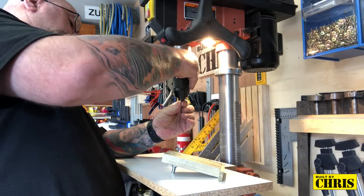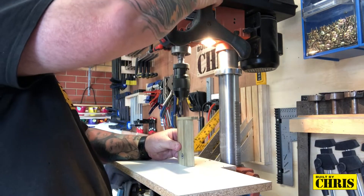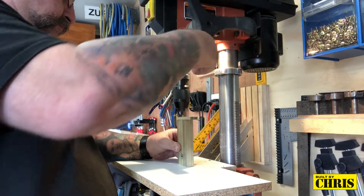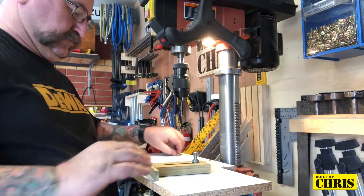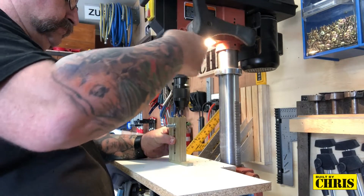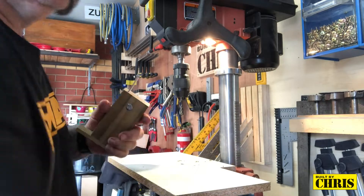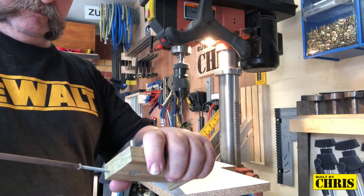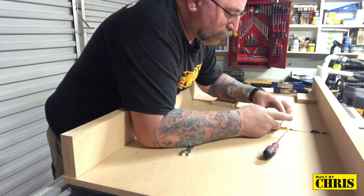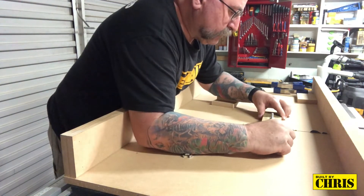Here I'm drilling the pilot hole to secure the end piece, and I'll drill another pilot hole at the other end which will become the adjustment screw for when you're adjusting it to your saw blade. I put the adjustment screw in the wrong piece initially, but I fixed that up once I realized my error. Finally I get to use the finished kerf maker — here I'm adjusting the adjustment screw to the width of my saw blade.